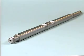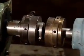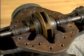The shaft of a centrifugal pump is a carefully machined cylindrical metal bar that transfers the rotational energy from a driver, usually an electric motor, to the pump's impeller. The pump shaft must be properly aligned with the driver's shaft to achieve smooth rotation and the best possible transfer of the driver's energy. The pump's other internal parts are attached to the shaft.